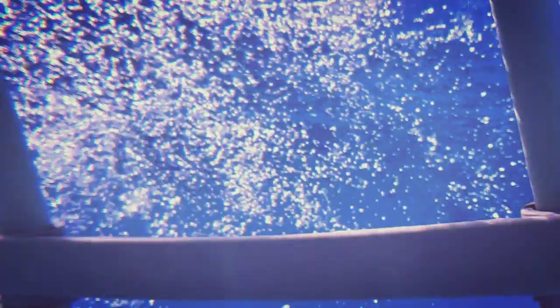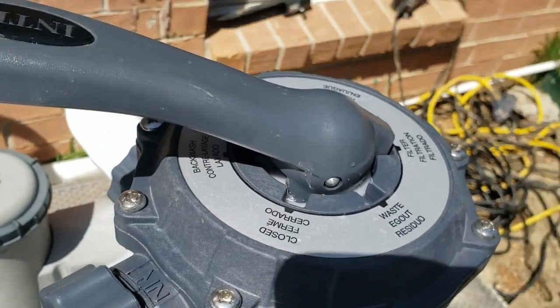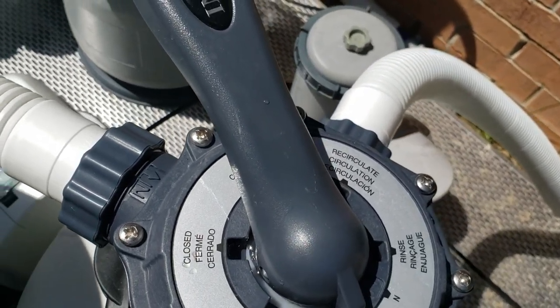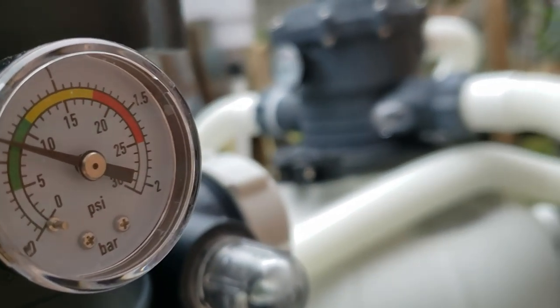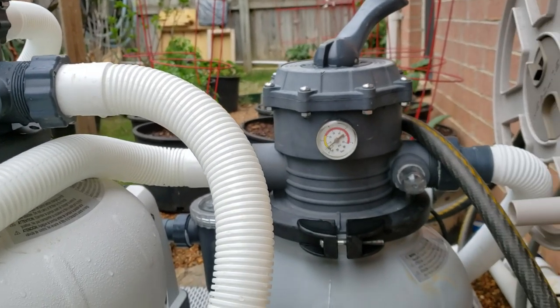The first setting is the filter setting — that's where your pump is going to spend most of its life. Dirty water comes in, cleaned water goes out during the filter setting. The next setting is backwash, which reverses the filter flow and forces all the dirty water up to the top of the sand and then out of the drain. Your first indicator of when you need a backwash is the pressure gauge — if it's out of the green and into the yellow, it's certainly time to backwash, or if your pool becomes contaminated for any reason.